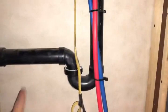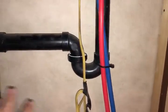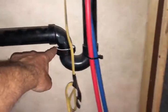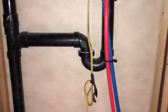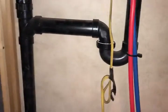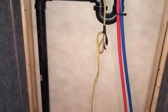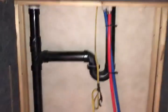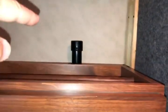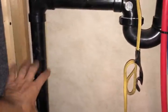They also have a drain pipe here that goes up to the top cabinet — it's capped off, that's your vent line. They've already put a piece of plywood with an electrical outlet, and you'll essentially need to cut that cap off to plumb in your drain line. I noticed the p-trap here — and you must have a p-trap. Do not install without one. A p-trap blocks sewer fumes from your gray water tank from getting inside your RV. There are also codes for how high the p-trap should be, how high the vent should be, and how far the drain drop should go. This washing machine wants the drain hose somewhere between 24 and 32 inches, but the top of this cabinet is 35 inches, so I'll need to lower this pipe.